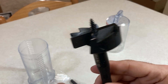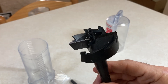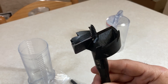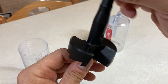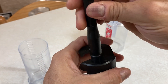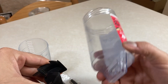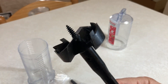I bought this because this bit is expensive — $45 for this bit. And for that price, I got an entire set of DeWalt tungsten carbide bits. So this one bit is expensive, but if you're drilling boring holes through timber and you have to do a lot of them quickly, you can't deal with a doorknob-style hole saw where you keep popping that core out. It takes forever, not to mention it's slow.